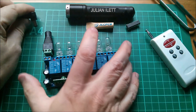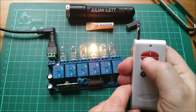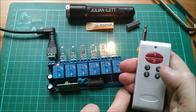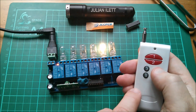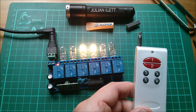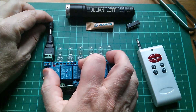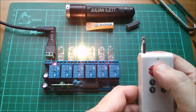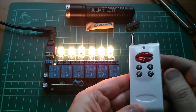That's gone in now. We should have a latching action — let's give that a try. Plug the power in and see if it latches. Oh yes! And you can replace any channel with another channel and it latches. Can you have two? Yes you can. But how do you switch a channel off? I'm sure I worked out a way of doing this... I can't find any way to reset all the relays other than removing the power. You can have all the outputs off that way, but there's no way to do it once one of them is on.